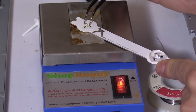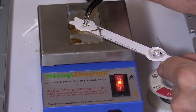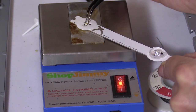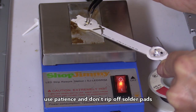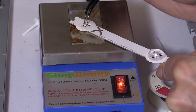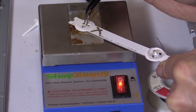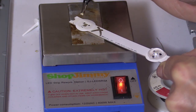I have tweezers — I'm going to heat it up on the heat pad and remove the diffuser lens. Then heat it up again and let that solder liquefy. Get tweezers and don't pry it off — if you rip off the solder pads, you'll have to replace the whole entire LED strip. Just wait until it liquefies and you'll feel it loosen up, then you can remove it gently. This one is actually cracked, so it's going to come out in two pieces — and there you go, slide it off just like that.